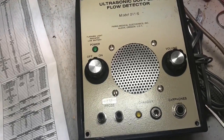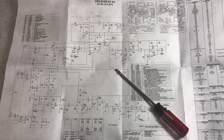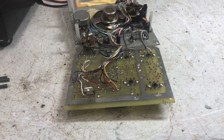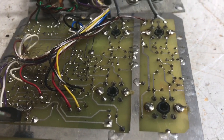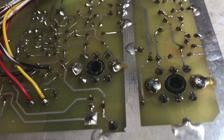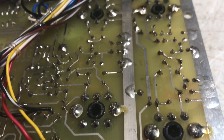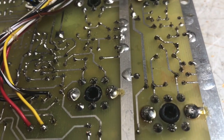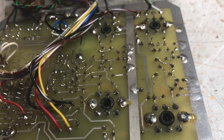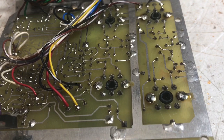We're going to start by taking the unit and changing the frequency — moving the transmit frequency and then readjusting the receive frequency to 8.1 megahertz. There are four tuned circuits on the board, and each one has a little ferrite core. The ferrite cores were sealed inside with a drop of wax, so I had to take a heat gun and heat up the board to get the wax fluid enough to remove the cores. I guess the factory didn't want anybody adjusting anything.